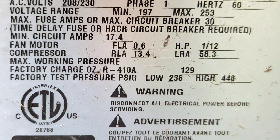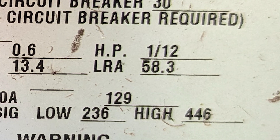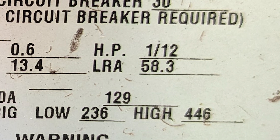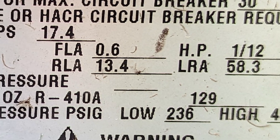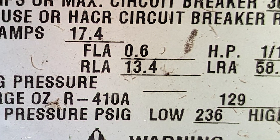As you can see on the outside unit's nameplate, this single-phase 230-volt unit is rated to draw up to just over 58 amps on startup. The term LRA shown here stands for locked rotor amps, which is the maximum current drawn by the compressor motor when its internal rotor shaft is still locked in place at startup. This current does drop substantially as soon as the compressor spins up to speed. The RLA, or running load amps, is way lower. Disclaimer and warning: only qualified or licensed technicians should attempt what I'm about to do here. Electricity can be dangerous.